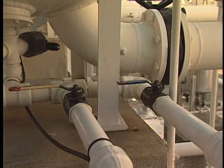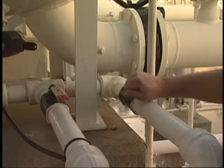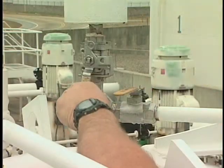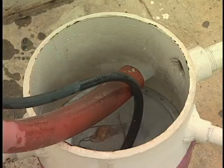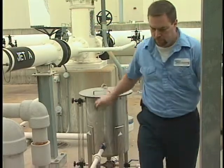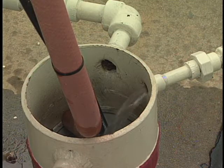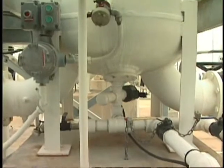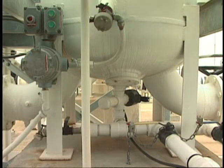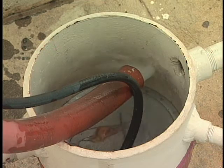Some vertical filter separators are equipped with two drain valves: a water drain valve and a dirty drain valve. The dirty drain valve is located on the coalescer inlet compartment side of the vessel. Open the water drain valve and dirty drain valves. Once draining has started, open the manual air valve if your vessel does not have an automatic air eliminator. Completely drain the vessel while continuing to monitor flow from the dirty drain valve to ensure no dirty fuel remains inside the coalescer compartment. Vessel fuel that is drained out is typically recovered in a fuel recovery tank, and a couple of gallons of clean drained fuel should be set aside to clean the separators later.